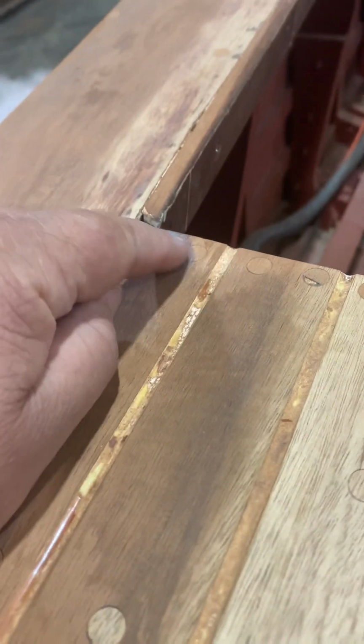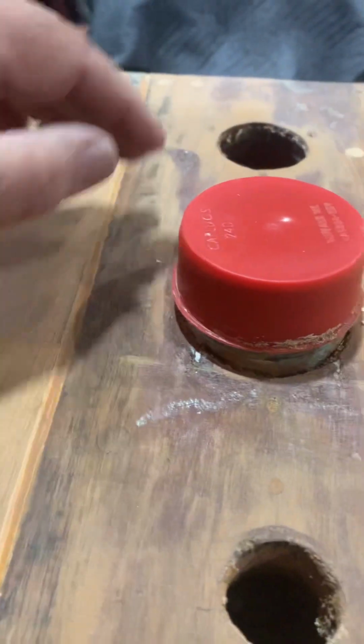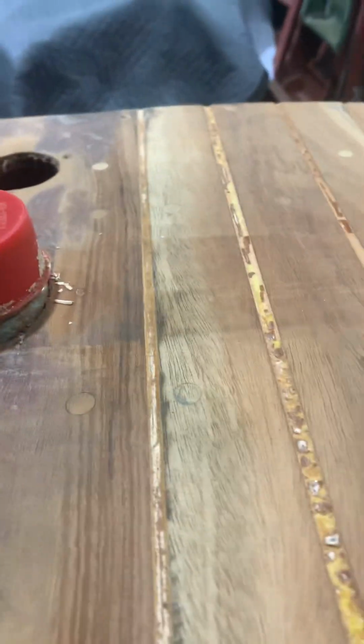Epoxy does not chemically strip. And you can see by the way this is sanding, this is epoxy. So you had someone put an epoxy coating over the stain, and all that epoxy has to get sanded out of the wood grain instead of chemically stripped. So we're going to take maybe a 32nd of an inch off your finish. We really like to chemically strip so we don't have to take so much meat.